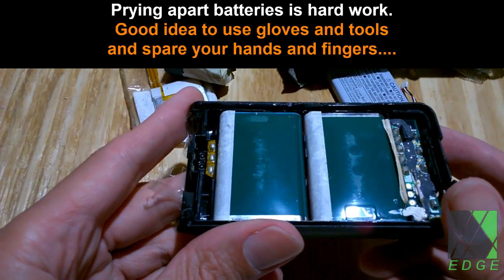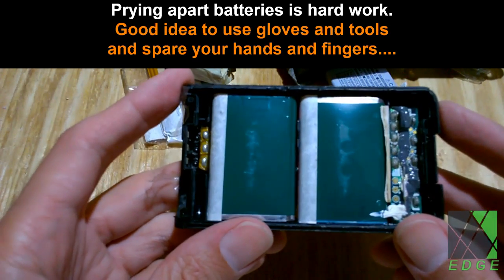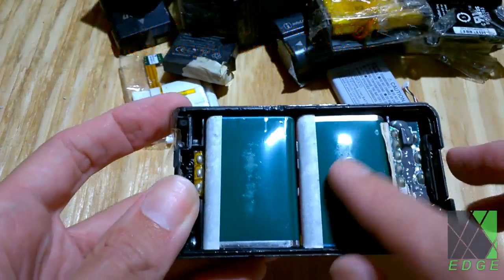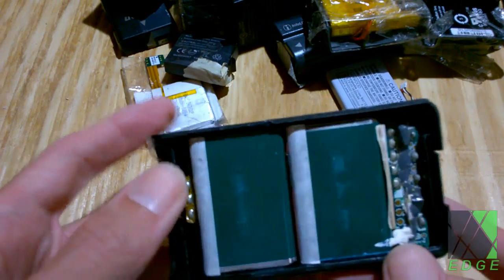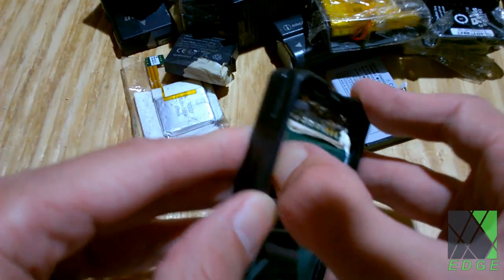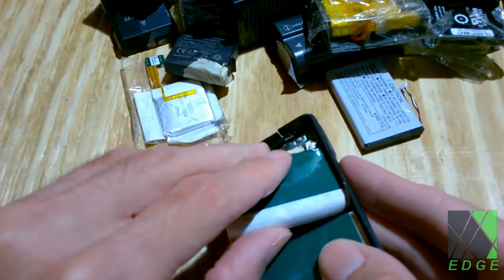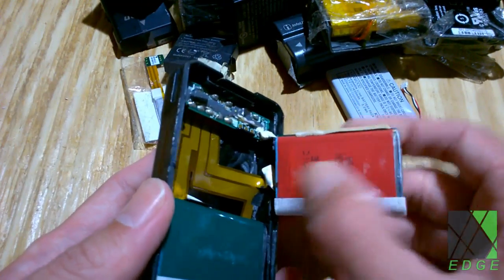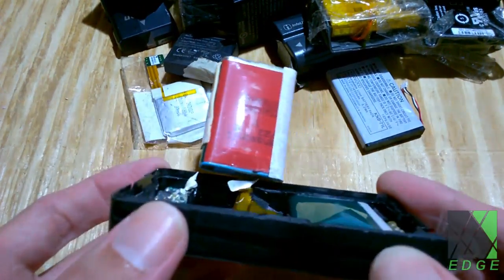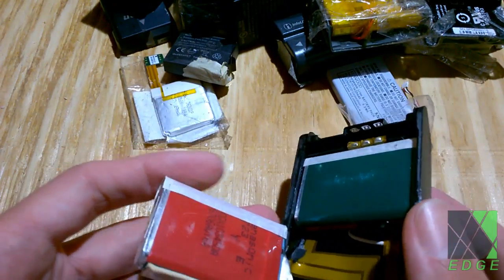This particular battery caught my eye. It's kind of a big battery and I popped the top off. It doesn't produce any voltage unfortunately. I'm going to try to get these cells out — there are pretty big cells. It's a 2S system or at least it appears to be. I'm just going to cut them off of this ribbon cable, or flat flex as it's called. You really never know what you're going to get in these battery packs — it's kind of mystery meat.